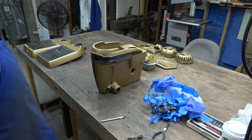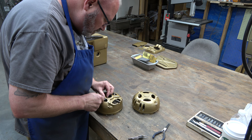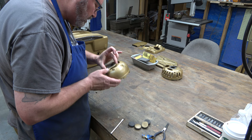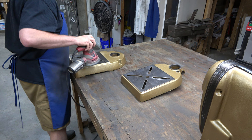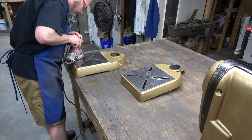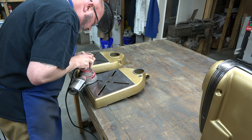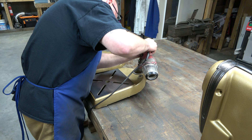That's the head done. Now we've got the two end bells for the motor — we're just going to push those rubber plugs straight through and then remove the masking on the boss, and we'll do that with both end bells. Now we're coming back with the oscillating sander with 320 grit, being careful not to touch any of the painted stuff, going back over the base and the table — the boss areas for the column and chuck key. We're doing a single pass to smooth out any of the hand-sanding areas we did with the 400 grit.